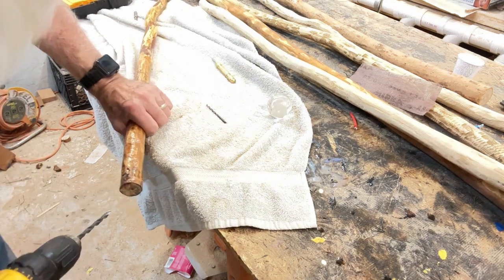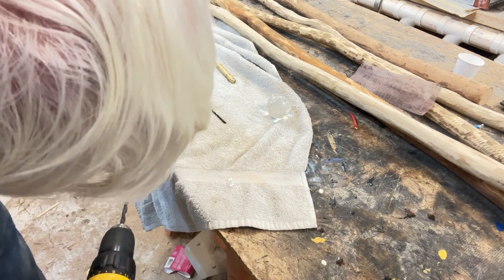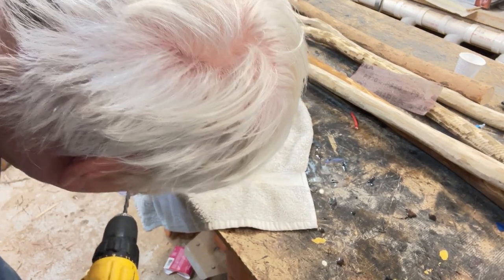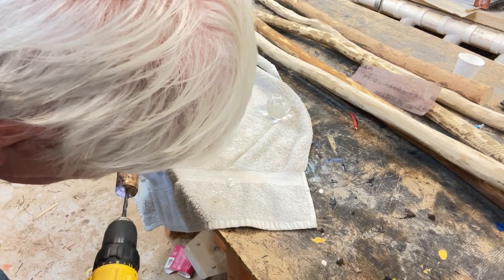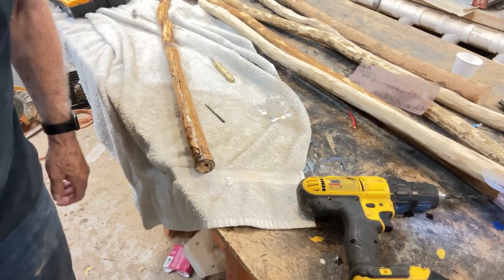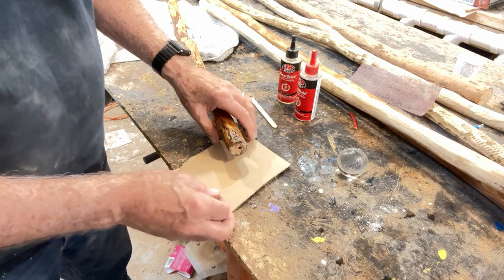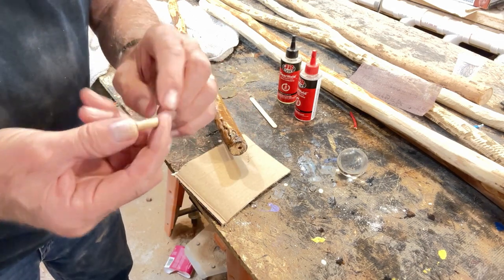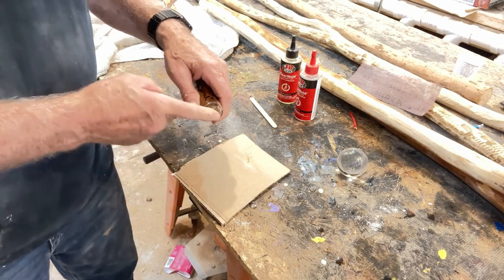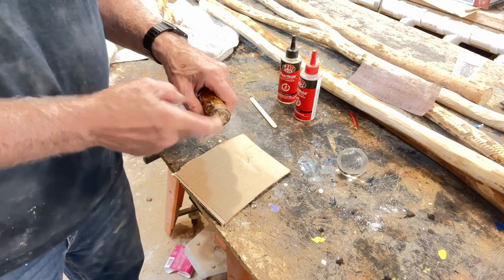Now I'm going to drill this one out, and on the wood, it does have a tendency to slip, so I get my hand back a little. Just a little is all we need. Now, after putting my drill bits, drill gun, and all away, I put my towel back out of the way a little bit, and I go cut me a 3/4 inch dowel, 1/4 inch, and I see that when it bottoms out, it just leaves a little, an eighth to 3/16 out of that hole.